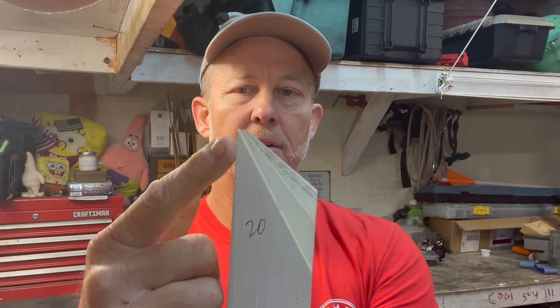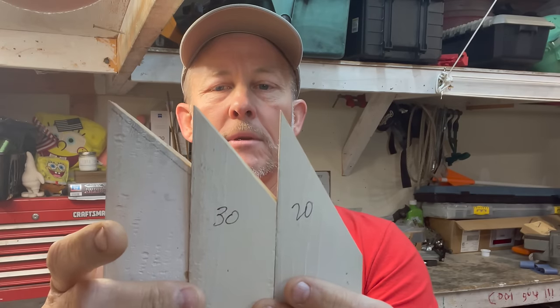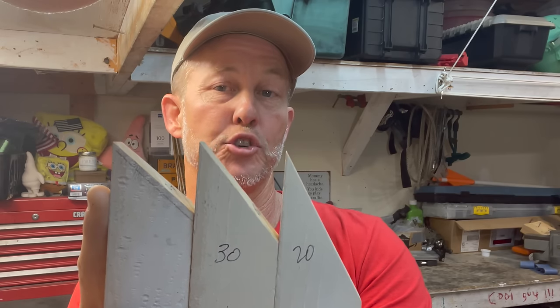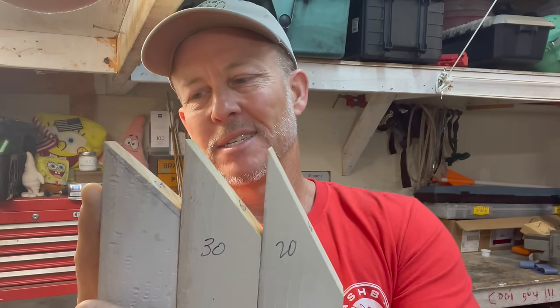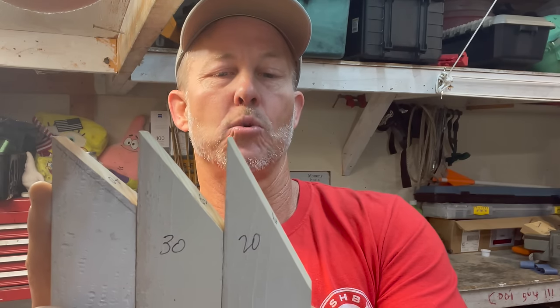When you stack them, it makes for a very interesting display of what "thin" means. The 20-degree bevel — you can see how thin it gets up here — and then 30 and 40. This is the 40-degree bevel. You can have a discussion around, again anecdotally, that the 40-degree bevel should be more durable because it's a steeper angle. But there's more to be studied on durability because you have steel quality and literally how well you sharpen the edge. It's mostly a steel quality issue.